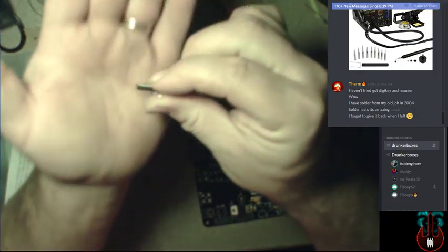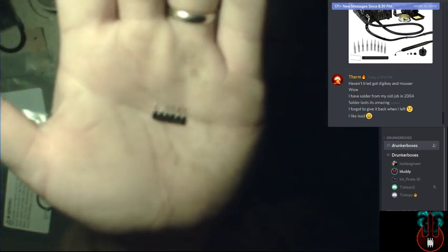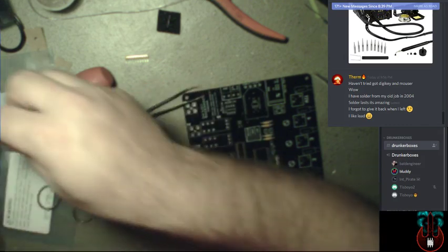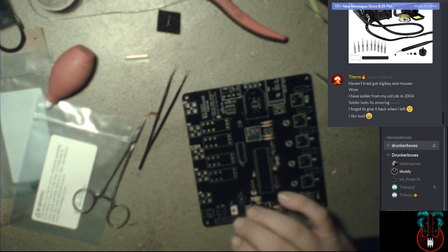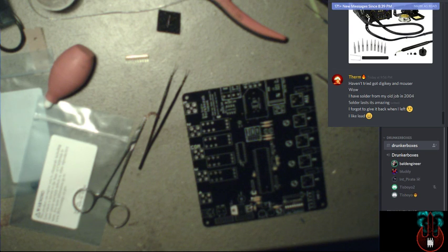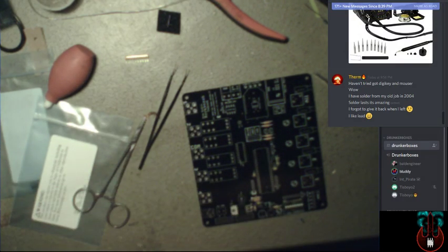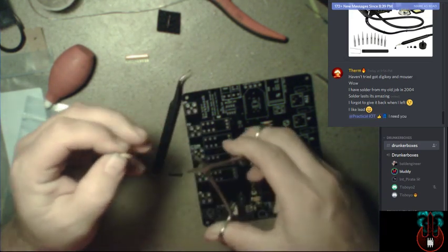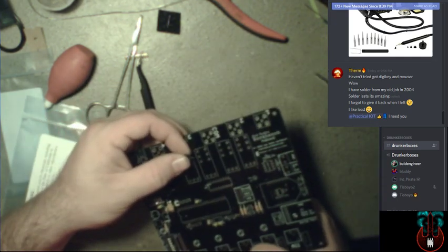I would actually think that at this point, lead free should start getting cheaper. It should, because there are a lot of countries that have already completely phased out leaded solder. It's now illegal in some countries. And they're thinking about doing that in the U.S. because of people getting lead poisoning from it. In the EU, you can still buy leaded solder. It's just that you can't ship anything with leaded solder once you have it. For that reason, if you go to somewhere like Premier Farnell, you can't really buy leaded solder. If you try to, it's more expensive. Wow. At some point I see the shift coming to where lead free is going to be the standard and leaded more expensive. Well, it's just quantity. There are no CMs doing leaded solder except for highly niche applications.